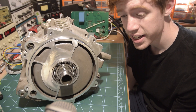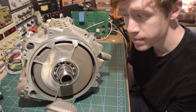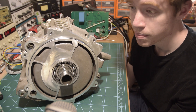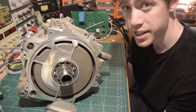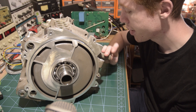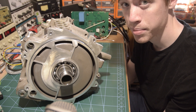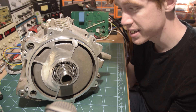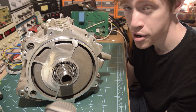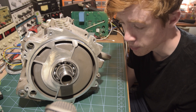The next thing I did to test it is connect it up to the three-phase inverter that I showed in the previous video. Now that can get nowhere near this motor's full current or full voltage, but it can give out a three-phase sine wave which is better than nothing. Running off the 800 volt system that apparently a Jaguar I-PACE has, I would expect this motor to probably have a max current in the order of 250 amps, and the beefiness of the terminals on the back support that. The limit of my current motor testing setup is 30 volts and 30 amps, so not close to either of those really, and with a current limit to be safe I can only do 5 amps — but that should be enough to get some kind of movement, which is all I really want.